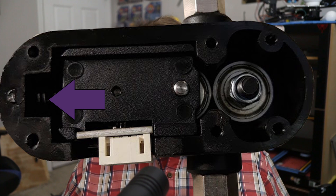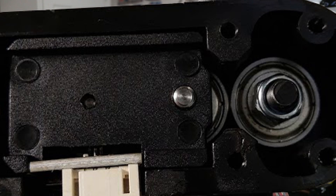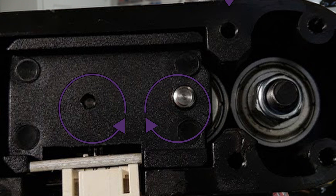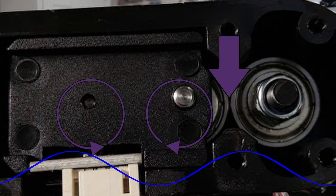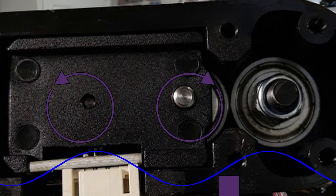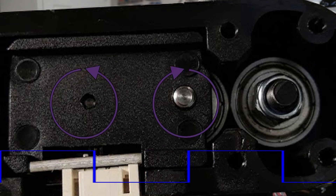The slit disk on the smart sensor is simply a wheel with round holes spaced evenly around the inside of the wheel. This wheel is pressed up against another bearing which comes directly in contact with the filament. The entire assembly is spring-loaded to press firmly against the filament. Located on the other side of the case is a second bearing, allowing the filament to be pinched between the two bearings, providing a bit of tolerance if the filament diameter varies. When filament is inserted and begins to pass through the assembly, the encoder wheel will rotate. As the light passes through the edge of the holes, the signal forms an analog wave similar to a sine wave, which is then passed into a Schmitt trigger chip, converting the sine wave to a square pulse. The signal is sent back to the main board along a single wire, with the remaining two conductors used to power the sensor itself.